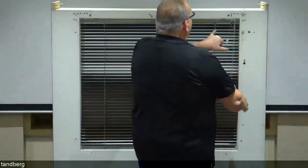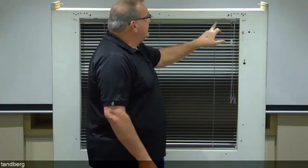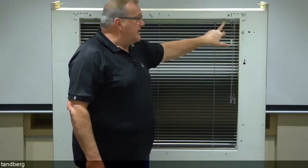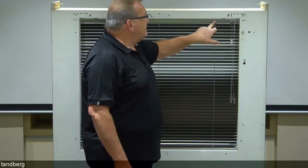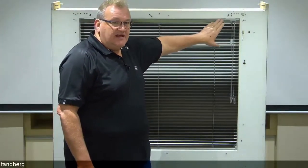Now, when you are fitting the installation brackets for an aluminium Venetian, be very careful not to mount the bracket in line where we have the tape drum and the tilter. We're saying have this bracket in approximately 80 millimetres from the end, but make sure we're not going to foul with any of that internal componentry that's in that head rail. So you do need to be conscious of that and look for that when you're positioning your brackets.